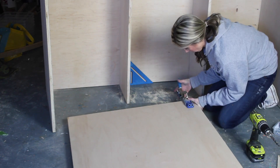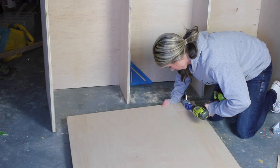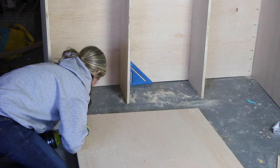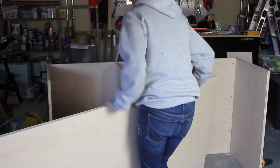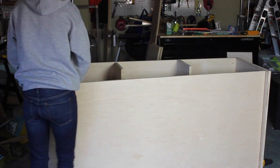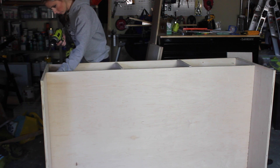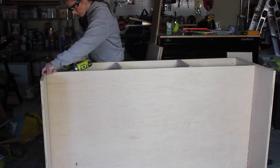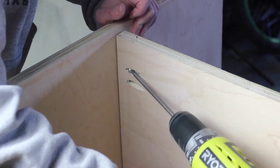Then I drilled a few pocket holes at each end of my remaining 63-inch by 33-inch sheet of plywood, which will end up being the seat or the bed portion. I slid the top into place — what will later be the top when we flip this thing upright — and awkwardly attached it to the sides with 1.25-inch pocket hole screws. I used a countersinking drill bit to pre-drill holes and 1.25-inch wood screws to attach the top to the cubby partition pieces.